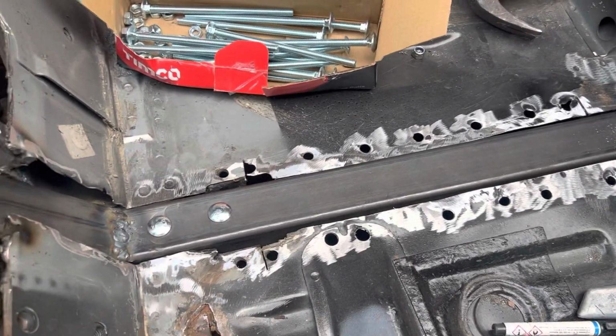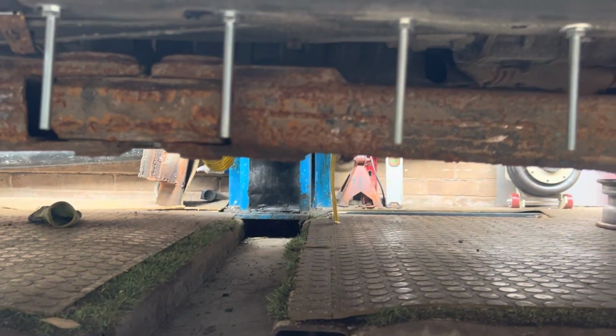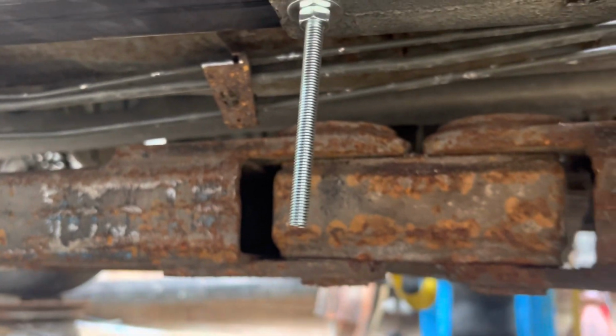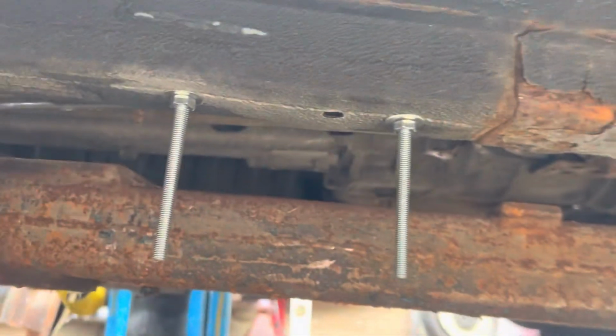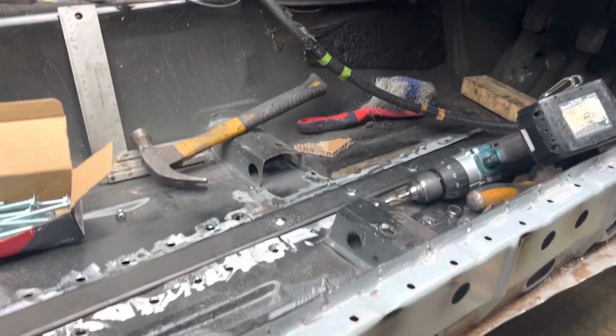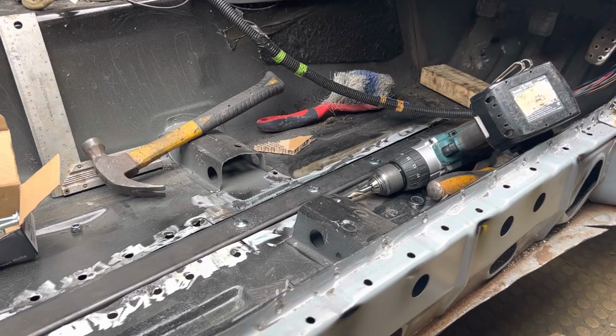Essentially, got two bolts in there, which you saw, I think, and then 1, 2, 3, 4 bolted in there. And under the car, obviously, I need to trim them out because they're going to stick down too low. But they're bolted now into the chassis. So we're bolted into the chassis rail. Chassis rail was solid as well. So when we split it, we're going to slide it down and we're going to be exactly 13 and a half centimetres longer on the wheelbase.